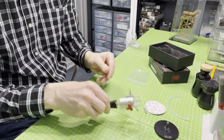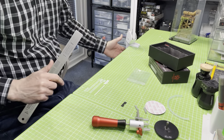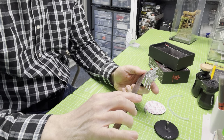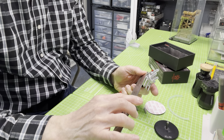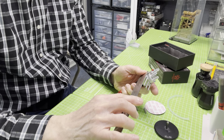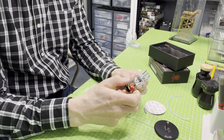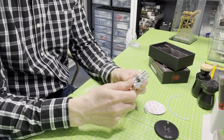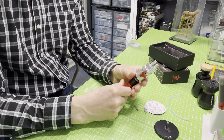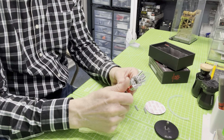Let me just reach for a ruler, because I know what you're going to ask — how far does this vise open? So measuring from there to there, that is five and a half centimetres. So that's the kind of size of part you should be able to hold with this thing when it's open to its absolute maximum. It takes a while to get to the end of course because it's a screw thread, but it's solid — that's not going to move around. It's not a badly made screw mechanism at all.